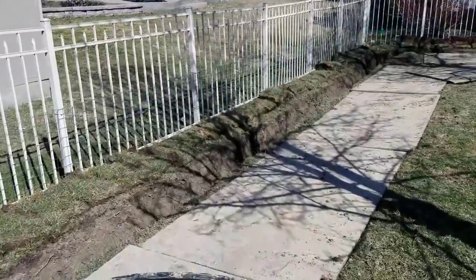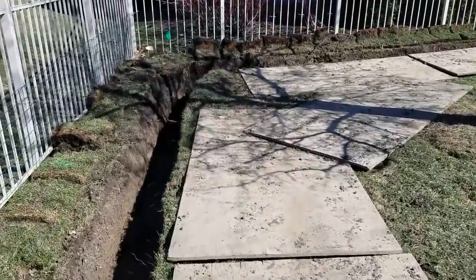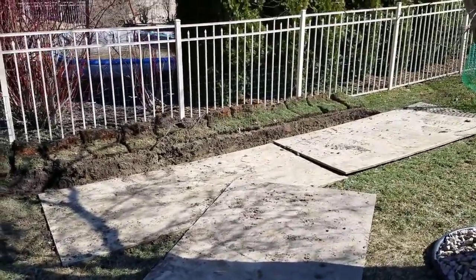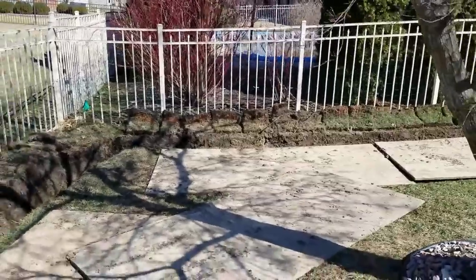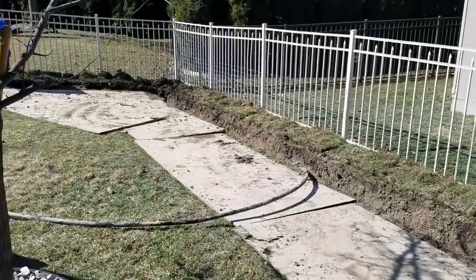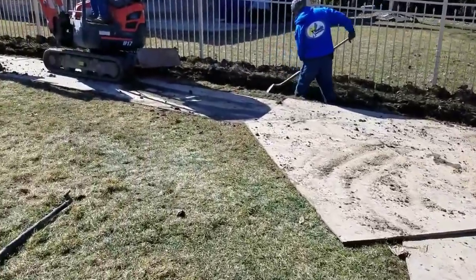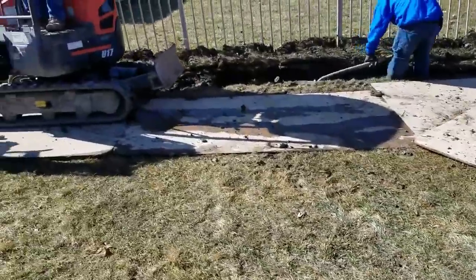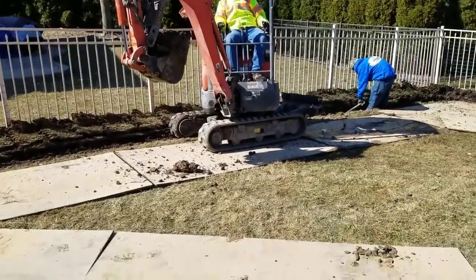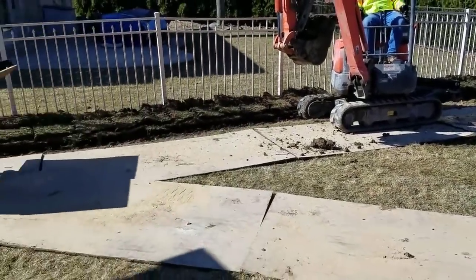The reason why a drain will actually work if you put a little bit of clay back over top of the stone is because it's now all broken up — but it won't last forever. What happens is, as that clay settles and compacts — you know, the very reason farmers are always tilling — once that soil compacts and all the air pockets are gone, that's when the system quits working.